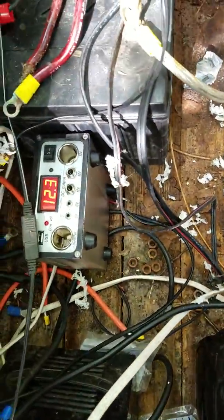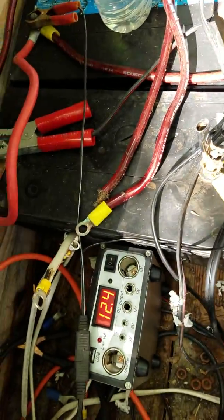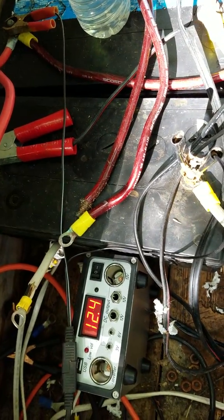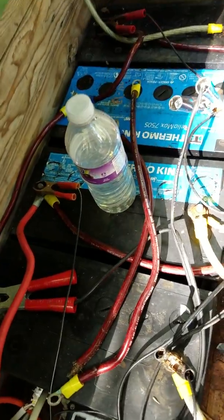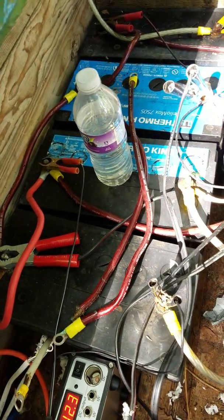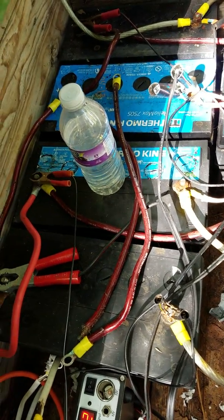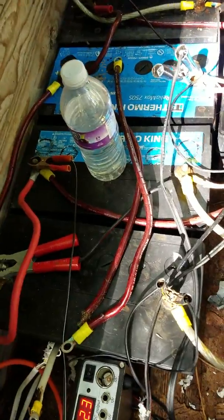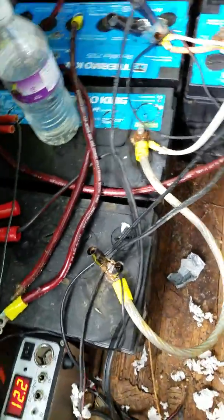At night I'll turn on the charger to make sure the batteries are charged, since I'll be running two used ones that don't hold power as well. I'll be able to see what kind of charge is in them. These other batteries I'll hit with the meter every day — morning and night. They'll only be charged by this charger for one to two hours each night, and they won't be feeding anything — just sitting there getting a free charge until they're sufficiently charged, around 13.5 volts, then I'll switch over to them.